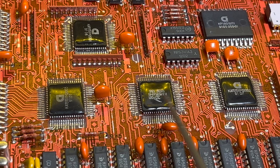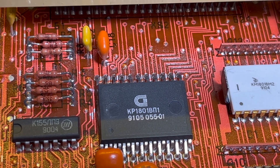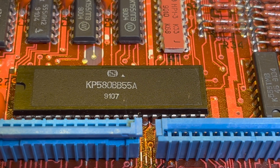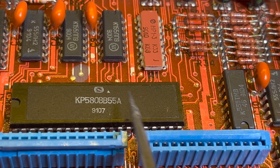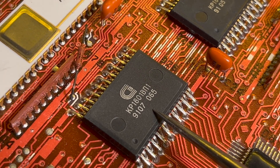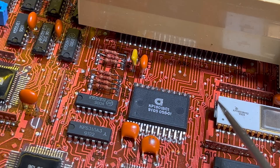We've got a KR1801 VP — what's a VPK? And then the firmware version is 55. I think this is a bi-directional buffer — the KR580VV55A — so this is the Intel 8255 programmable parallel I/O clone. You'd see that in an 8080 system, so they've reused it here. The 1801 65 is serial interface — that's what I thought I saw on the network controller — and 120 is interbus communication between CPU and peripheral processor.